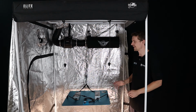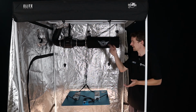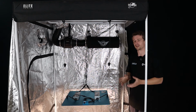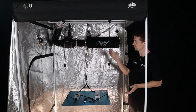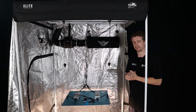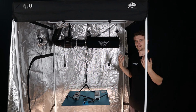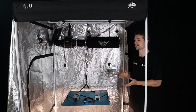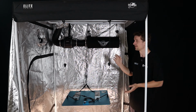Now it's worth mentioning air changes here, because swapping from an AC Infinity that we have there to, let's say, the Imperial mixed flow fan, you are looking at about 1 air change every minute, which is not bad of course, but when you go to the AC Infinity of the same size, you're looking at about 2 air changes every minute. Now for those who have this equipment installed in a really hot climate, like a tin shed, and they really need a lot of air movement, the 6-inch or 150mm equipment is going to deliver 4 air changes per minute. So that is quite a considerable step up over this equipment featured here.